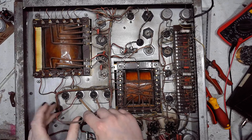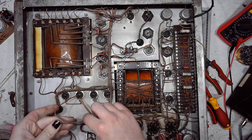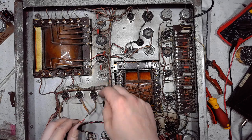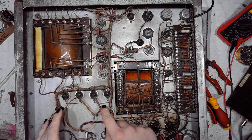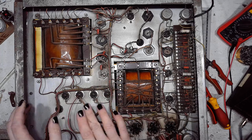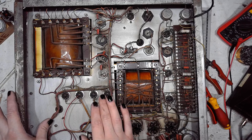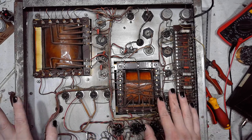If you see here, this is also a circuit modification uncovering the... Can I uncover it? Not right now, but I'm absolutely certain that those are 1N4007 diodes, probably connected 2 in series, replacing the original EY88 rectifier diodes.